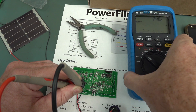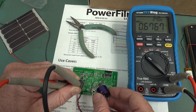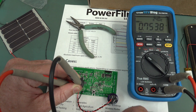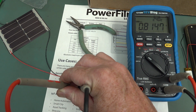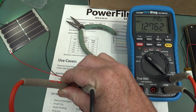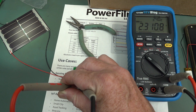Hey, now we're talking - we're even overflowing. I've got a 2,200 microfarad cap, which says 1,800 mic minimum. And that's charging fairly rapidly. If I turn my torch on, it's going to charge even quicker. And apparently the Bluetooth turns on at about 3.2 volts.